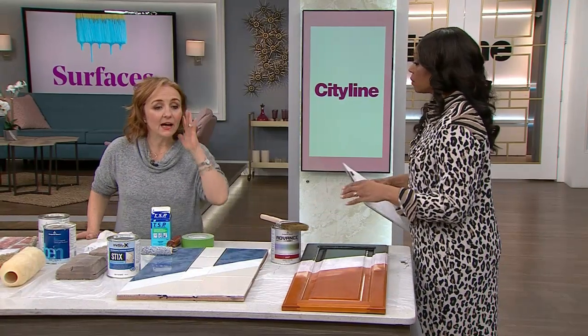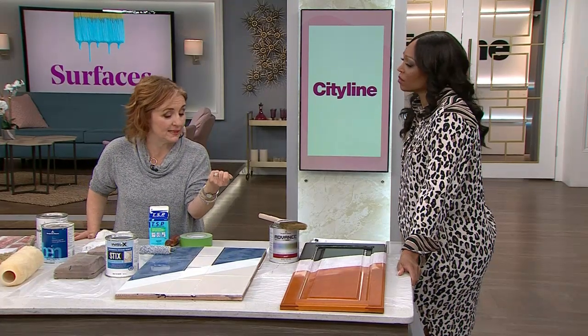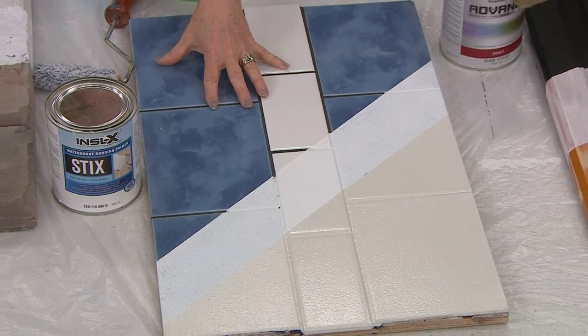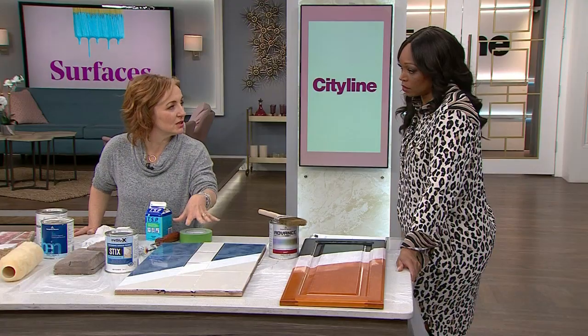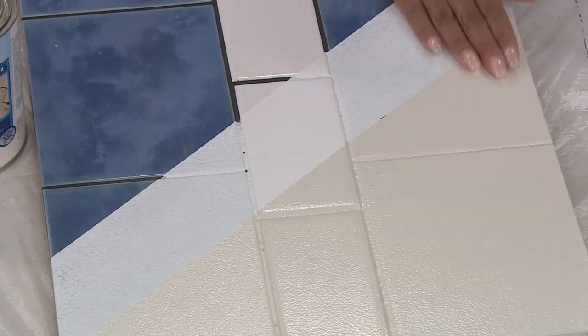Now let's look at tile. I have a photograph of another project we just did — another beautifully painted white house where we wanted to paint everything out. They were going to replace the tile, but painting it saves money. When painting over tile it depends on the type: that case was a rough finish, so quite easy. If you have a really glossy tile it's trickier, but you still can paint it. Scuff it with 60 or 80 grit sandpaper, then definitely use Sticks primer — it adheres to hard-to-paint surfaces. Then I used Advance in a beigy cream color called Clay Beige.